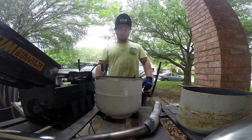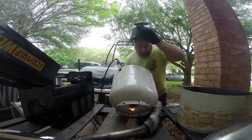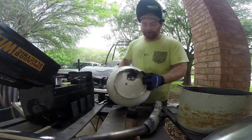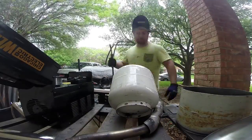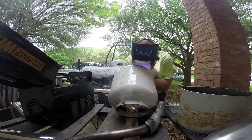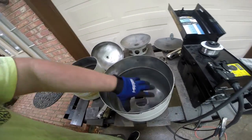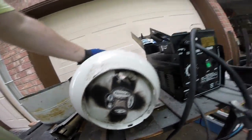For those curious, I've got the welder set up on maximum power, feed rate is around five to five and a half, and we're gonna see how well that does. One way you can tell you're getting good penetration: when your weld is running a bead along the outside of this thin metal, you'll see burn-through on the backside. I can see I'm getting good penetration into both pieces. There it is, nice and welded all around. Since this is going to be filled with cement, we're not super worried about movement, but it's nice that it's welded solidly in place.